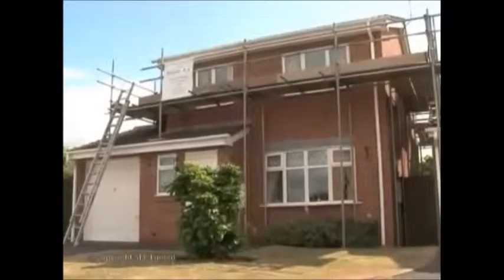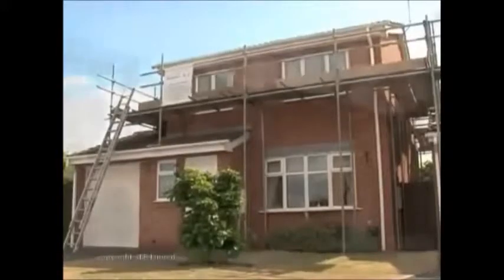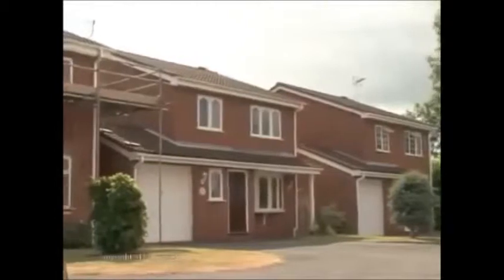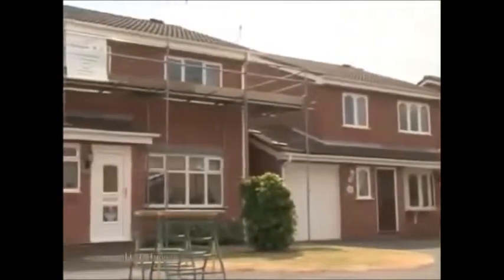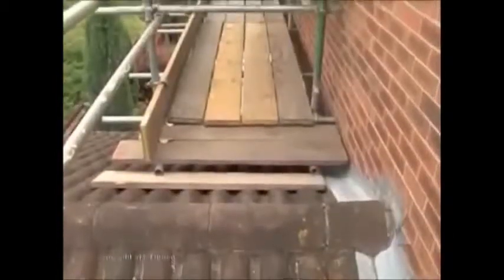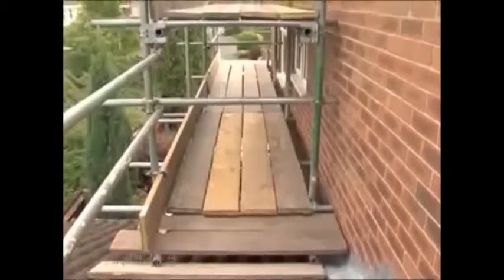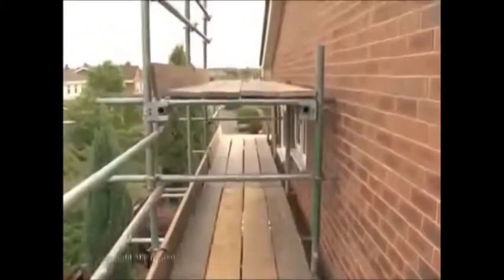Techniques for doing certain jobs, but it is important to follow a number of standard procedures when fitting any job. Always think safety first. The property must be inspected for asbestos materials, which are sometimes found in the soffit board. If you are in any doubt, the local authority should be consulted about removal. Work from a full scaffold system like this one, with kickboards and guardrails in place. The job will be easier and safer, and you can get it done properly.